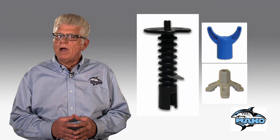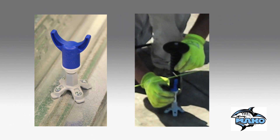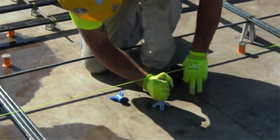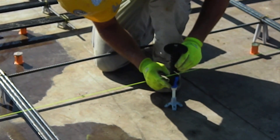The second setup uses the fin cap, fin stand, and driver. This setup is used for wood or metal elevated decks. There are two ways to set up. The fin stand is designed to straddle the lower deformation, so setup is fast and easy. Once you have the fin stand in place, screw it into the deck and you're ready to go. On wood decks, use short nails so the form can be easily stripped away when the slab is cured.